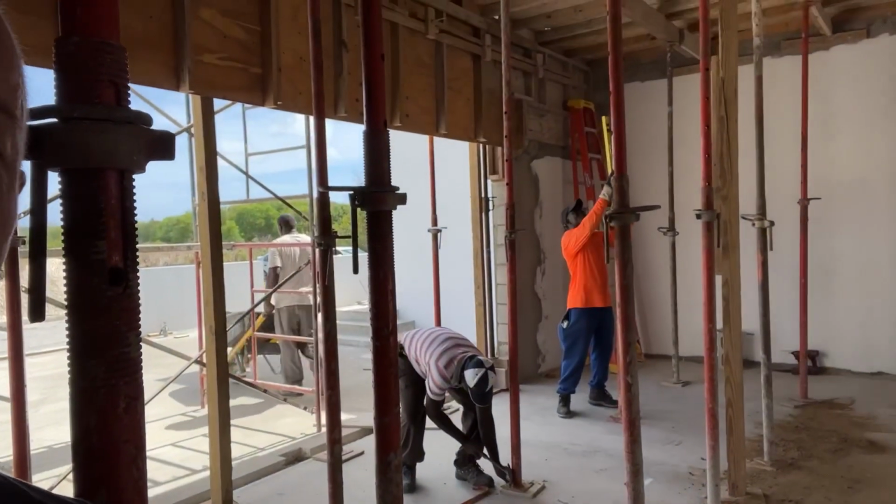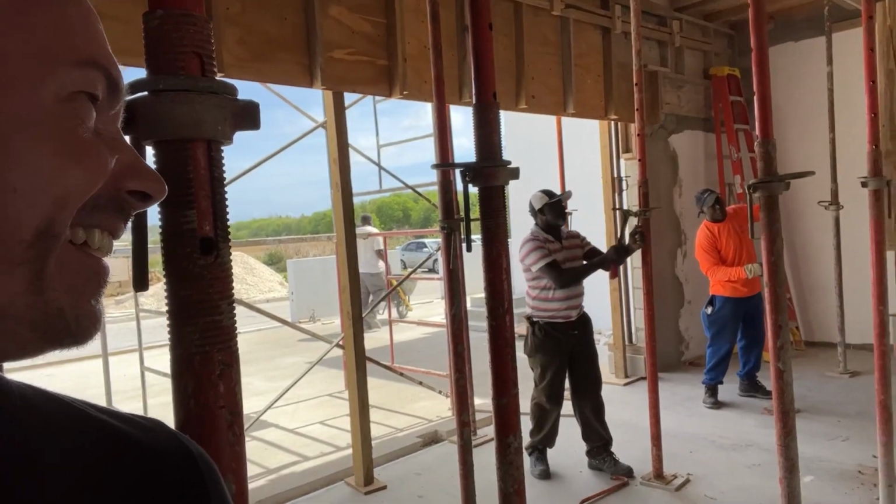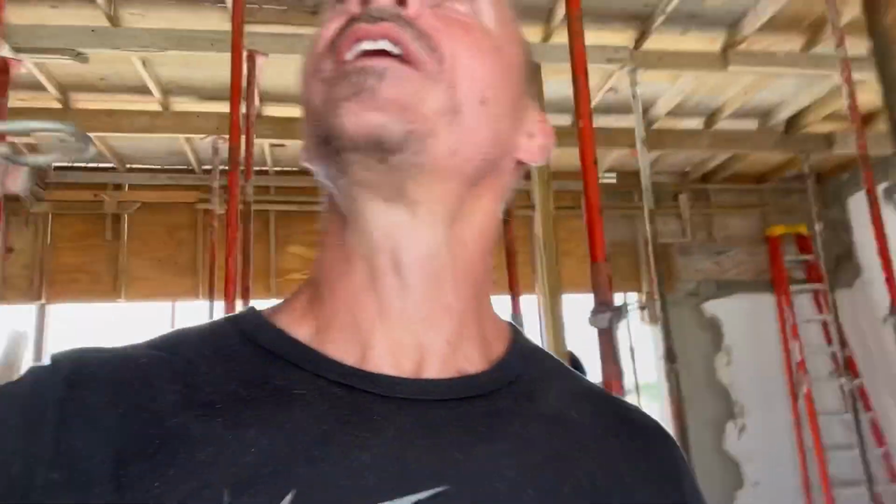Okay, so we're at 9:45. Sand is going down for the leakage. 4 trucks are on route. Pump's already here, set up, ready, waiting. So yeah, the sand goes down, obviously, because there's gaps in the ply and the concrete comes through. So hopefully not overloading the place, but obviously we'll be in here underneath once it's pouring. But be careful, obviously, just make sure that the lot doesn't come down on you. So it's laying it down, making sure we can catch as much of the leakage as possible.